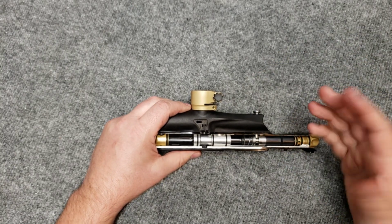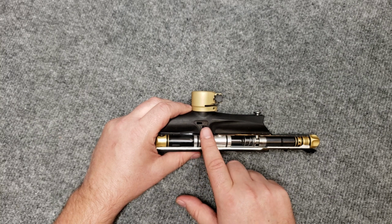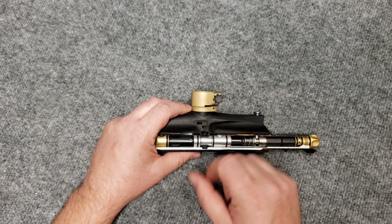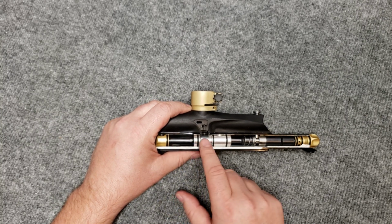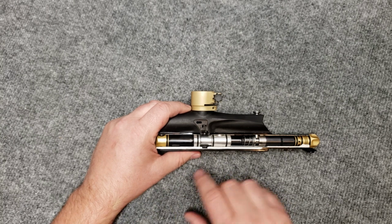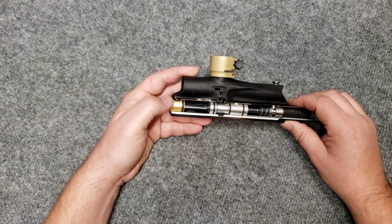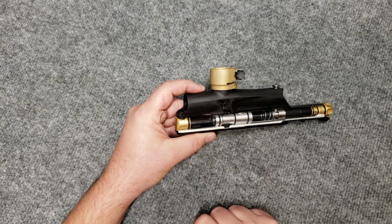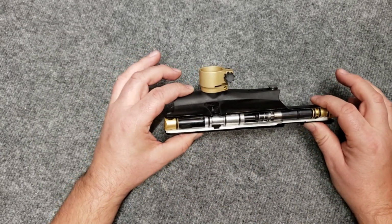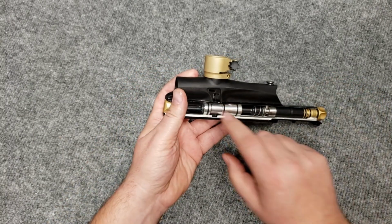torque. When you need to get into the valve for a possible valve leak, you'll get a valve leak right here, and you'll hear that come up through the body. And if you hear any type of leaking up here towards the front of the gun, it's normally this O-ring here. I've had a couple because people use the wrong material or wrong lube. The O-rings in here would tear up and get destroyed, and this O-ring here went on a couple ones I had to rebuild. Or, in the process of assembling it, you can slice these O-rings just slightly, and possibly this O-ring here. So we'll go over how to do that without damaging those O-rings, and what to watch for if you have a leak up here.